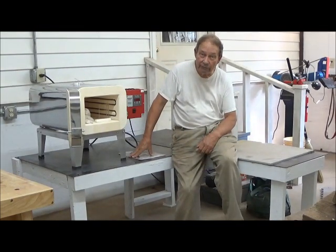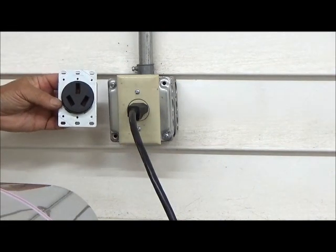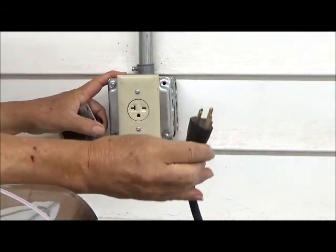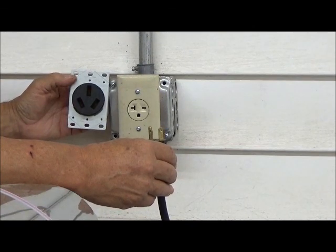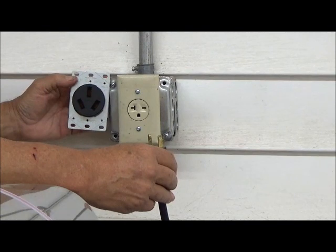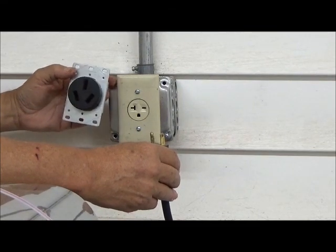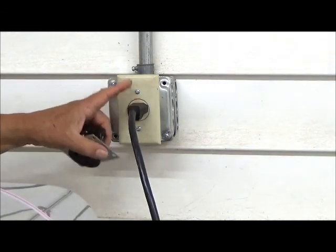We're going to be off and running with this, and when we temper the first batch of knives, we'll let you see how. One thing I need to tell you about is this 220 plug. We had a 220 plug but the one that came on the machine is much different in shape. You can convert them — it just involves changing three wires — but you want to make sure the ground wire goes in the right place. The other two can go on either side since this is a heating unit and doesn't have an engine that needs current flowing from any particular direction. You can reinstall these yourself; just pay particular attention to where the ground wire goes, and of course make sure you turn off all the current when you do it.